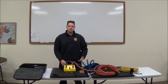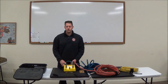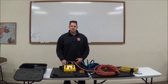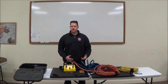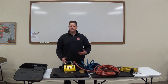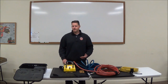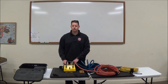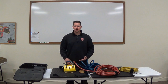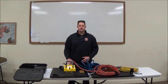Color-coding makes it easy to call commands. Whoever is in command calls the shots — for example, 'up on red' means inflate red until told to stop; 'down on red' means deflate the red bag. Ideally we want several people involved in a lifting operation: at least somebody placing the cribbing and somebody operating the controller. If that's all we have, the person placing cribbing calls the commands. With an additional person, it's ideal to have someone in command who can stand back, look at the big picture, and communicate between the cribbing team and the controller. A safety officer who's not directly involved can watch the load for any shifts or unsafe acts.